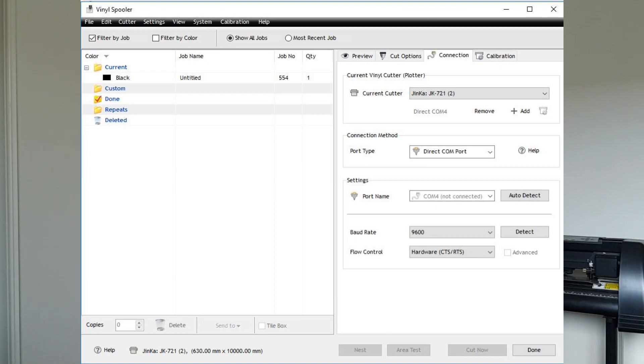For whatever reason, even though it's plugged in via USB, I had to choose COM port. Then down in the settings section you can see it's got COM 4 — in the past I've had to have it on COM 2 or COM 1. You just change around the settings until it works — it's purely trial and error. It's possible it's connecting through a virtual COM port rather than the USB port directly, so just try different COM port numbers.